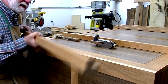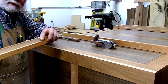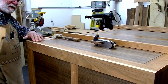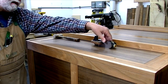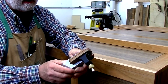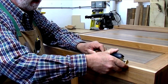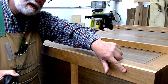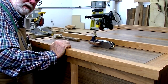Here's a close-up of the fitting of these legs. You can see the notch I put in the leg and it fits around the bottom like that. Because the back and sides need to be flush, I went ahead and used my skew plane — it has a guide on it and runs kind of like a rabbet plane — to make this joint between the side and the back perfectly smooth and level, so when the leg glues in it will be nice and tight.